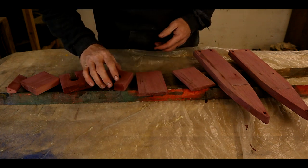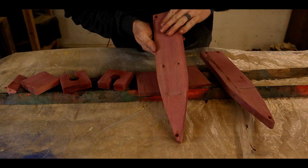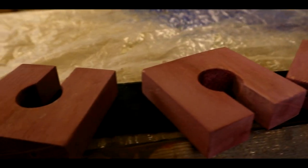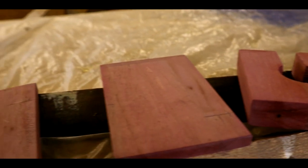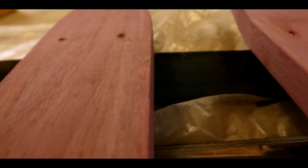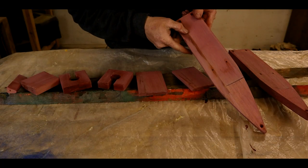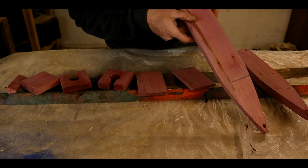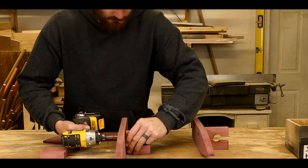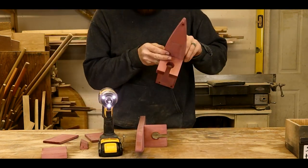I love the way these turned out. I noticed that the screws left a little bit of a mark on the wood, and the wine really ended up bringing out that flaw. I think the material from the screws reacted with the wine in some way — I'm not really sure why that happened. If anyone is wanting to try this, I would say do not put any screws in during any pre-assembly; I think that would fix the issue. I also ended up with this really interesting blemish — I'm not sure what caused this one, so your guess is as good as mine. I still think it adds a lot of character, but it's something I would like to try to avoid in the future. I really do like the way this turned out.